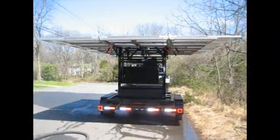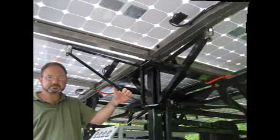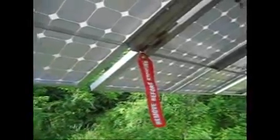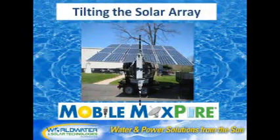There's 2 support arms. Swing the support arms out on the right and left sides and be sure that the locking pins are in place on the underside of the wing. Do this for both wings. Be sure that you do not walk underneath the wings until the support arms are locked into place. There are 4 areas to insert array locking pins. These locking pins are inserted to provide the array with additional stability in the case of high winds and to create one integrated flat unit of solar panels.